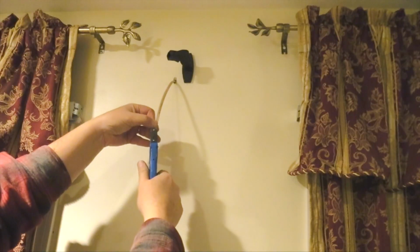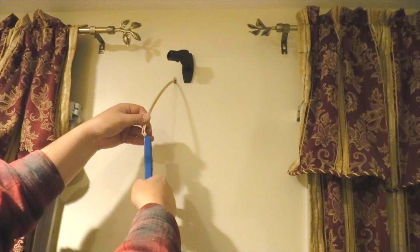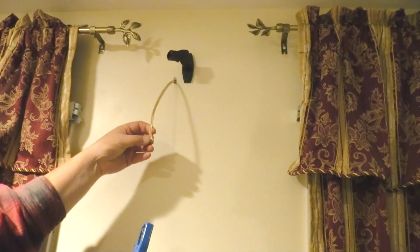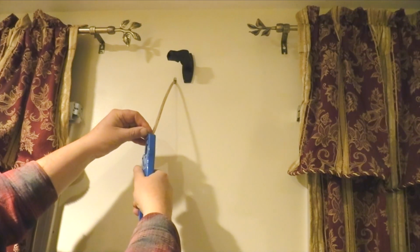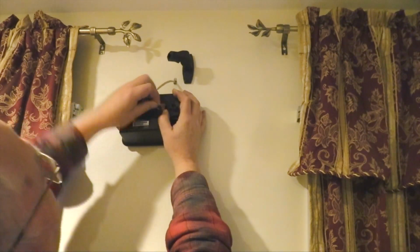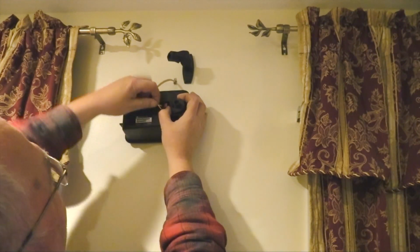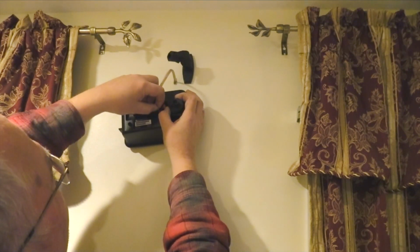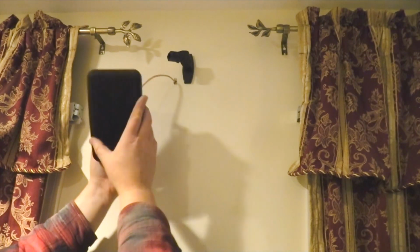wall. I'm using an automatic wire stripper to remove the insulation from the speaker wires. If you're unfamiliar with automatic wire strippers, they have a stop guide and a set of clamping jaws that hold the wire as the cutting teeth cut and extract the sheathing. The striped wire is considered positive and should be connected to the same terminal on all speakers to maintain speaker phase. I connected the striped wire to the red terminal on all the speakers.